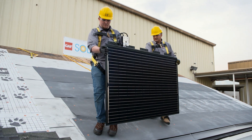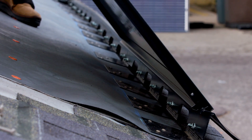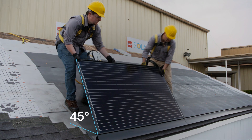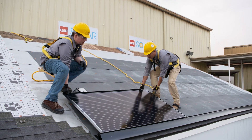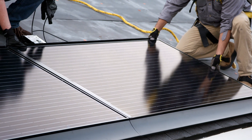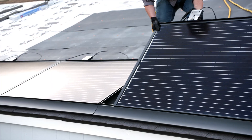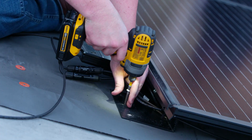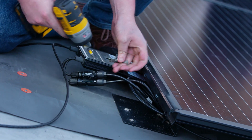The solar panel and starter bar have interlocking J channels that hook into one another. The panel is held at a 45-degree angle to latch into the starter bar and then lowered into place. Ideally, the solar panels fit square and snug together on the decking. There are often variations on the decking — that's why our solar panels come with adjustable feet. The reveal between panels should not exceed one-sixteenth to a quarter inch. Once all the panels are positioned, they're secured to the deck with GAF-approved fasteners.